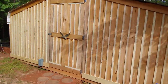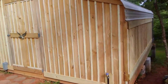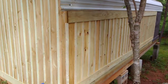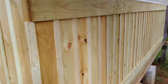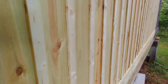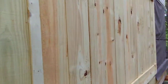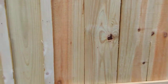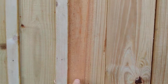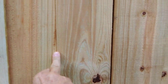If budget is an issue, you can't do much better than this. The boards, depending on what part of the country you live in, could be less than $2 a board — around $2 here at the time this video was made. You can see right here I ran out of strips and I've got to go get some more. This is the last one I put on, putting them at every seam just like a typical board and batten.